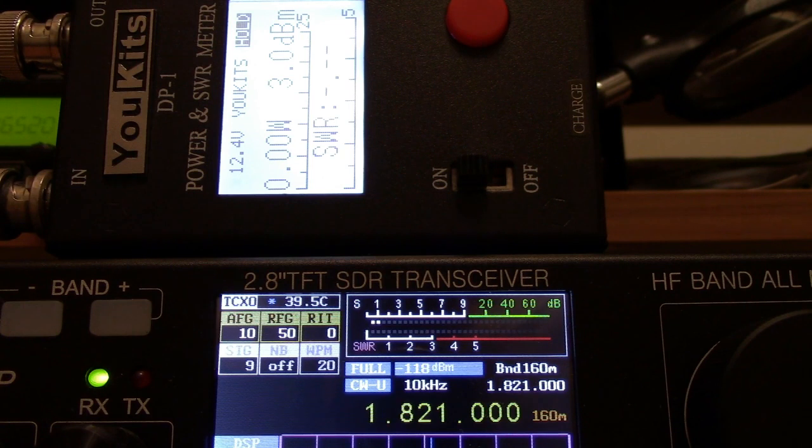What I've done is I have the most current firmware in it. I haven't updated the bootloader yet to the most current firmware, but I do have the most recent firmware for the radio itself as of yesterday. I've adjusted the power settings in the radio to suit myself — I'm a CW operator. I've set the high power level for 10 watts maximum, the legal single sideband QRP limit, and I've also set my 5 watt setting for 5 watts. I have set it up for 5 watts and 10 watts on all the bands currently for the CW portion of the band. It does change as you go up and off frequencies on either side of the band pass filter, but for now I'm running the test here on CW.